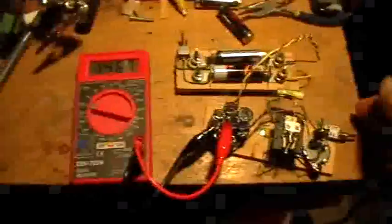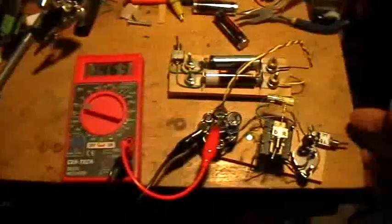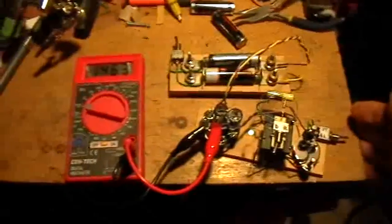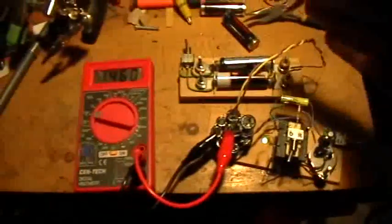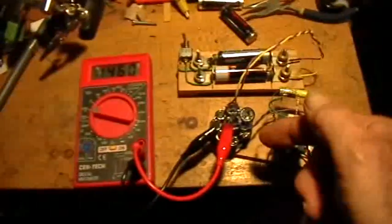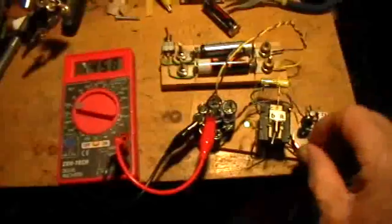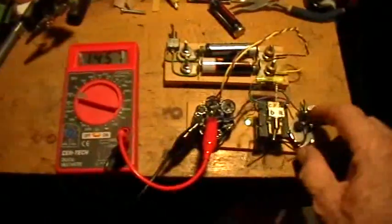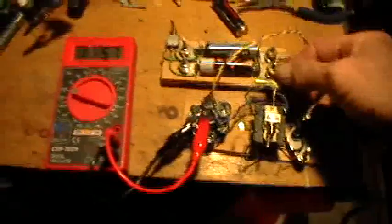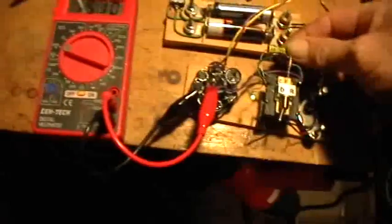So let's say you're running along with a nice joule thief. You've got a normal rate of charge depletion — a couple of seconds per millivolt. It kind of stabilizes out. Looks like everything's nice. You've got a nice normal bright LED. There are no weird effects from touching and nothing turning on. And then you take your 1 microfarad capacitor and hook it into the circuit.